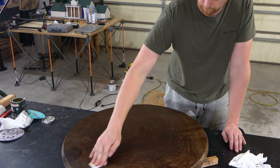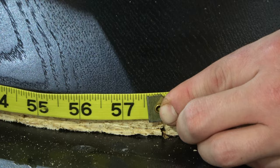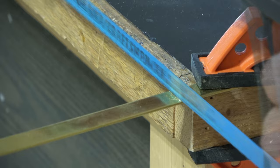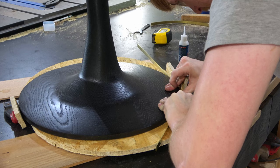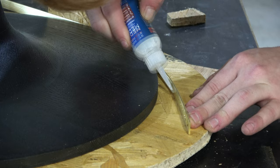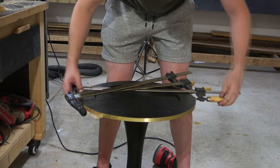After that there was still one more thing I needed to do to the base — add that brass band around the bottom. I used a measuring tape to find the dimensions I needed, then cut the brass to length and wrapped it around the base, bending it along the way. I used CA glue to attach it in a few sections at a time to make sure I had even clamping pressure all the way around. I later came back with some tiny brass screws to hold the band in place along the base, just to make sure it holds forever since I was worried about the CA glue coming apart over time.